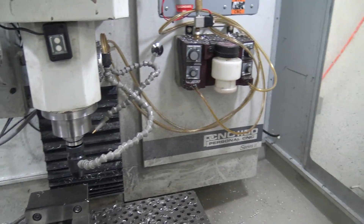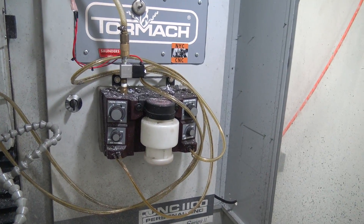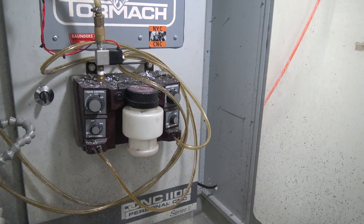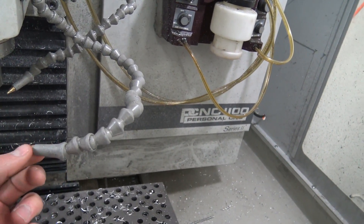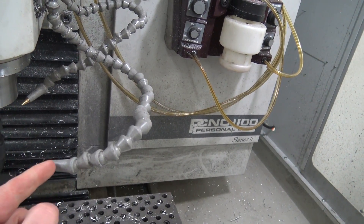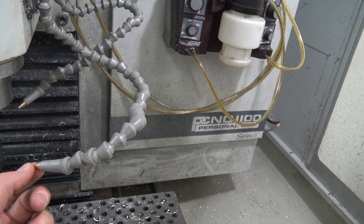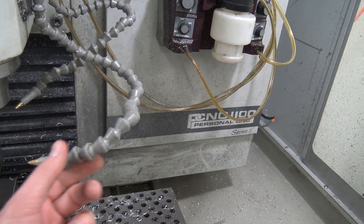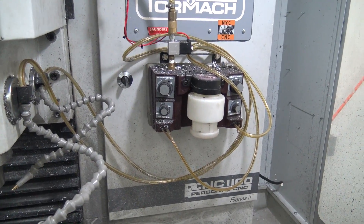The Trico — nothing wrong with it, but it's significantly more expensive. Ours has actually really deteriorated lately, partly due to its age and use, but these nozzles tend to get brittle and crack. Unlike the Fogbuster, where it's just a generic brass tube, this tip is proprietary and actually part of the mixing in the system. So you've got to buy these replacements, and I didn't find that to be the best experience.